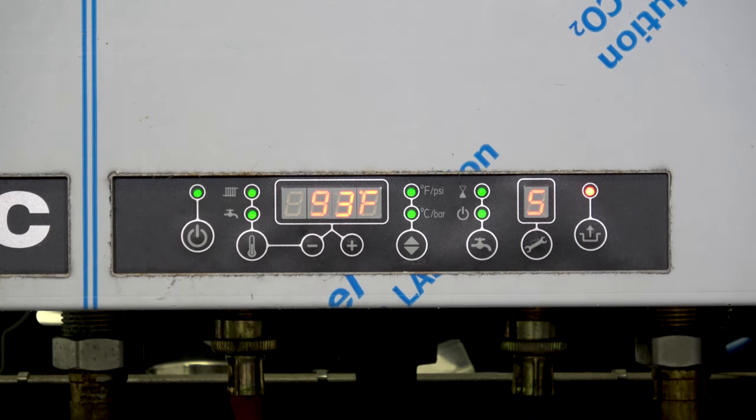We press wrench and go into option 8 — the internal boiler post-pump purge. At the end of a call for heat, there's an internal primary loop pump that will run for however many minutes after the end of the call for heat. We've got heat built up in the block, so we continue running it through. One minute is a fine setting — let's keep it there.